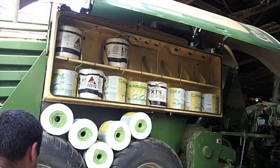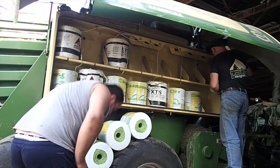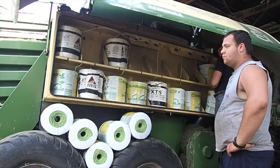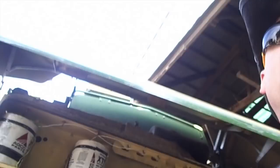Give me a ball of twine. Every single ball that you use or that you change, you actually have to move the ball that's being used to the upper position, which quite honestly is not ideal for me because this model Krone does not have the twine boxes that move downward like the eight-tie Krone does. With that one, all she does is just kind of tuck it in there.